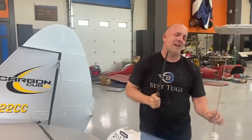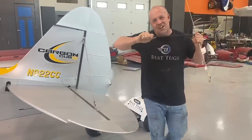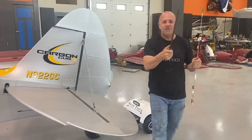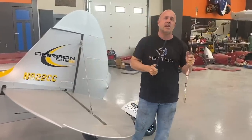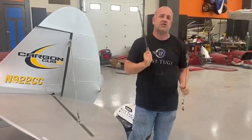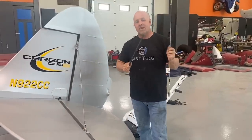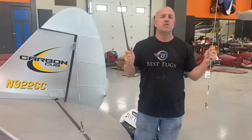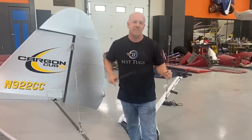The reason I'm gonna do carbon fiber is, when you try and stretch carbon fiber, if you have the correct weave, it can't stretch. You can, but it takes so much more force to stretch carbon fiber versus a steel wire that I won't ever have to retighten it or change the tension. It's just a little less maintenance.